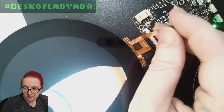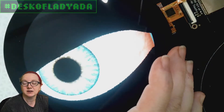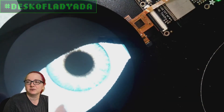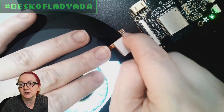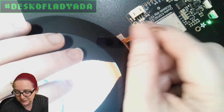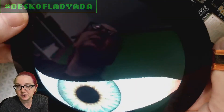So I'm going to have to make a little breakout board to attach to the capacitive touch. This is a Goodix GT911 — all these capacitive touch drivers are very, very similar, so that's not the problem. What's nice about the ones with built-in touch through the FPC is that it connects through to the ESP32-S3 with no dangly bits left over. But you can see I've got the eyeball code working.